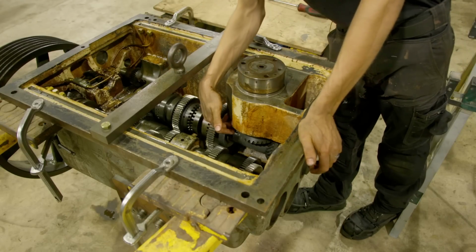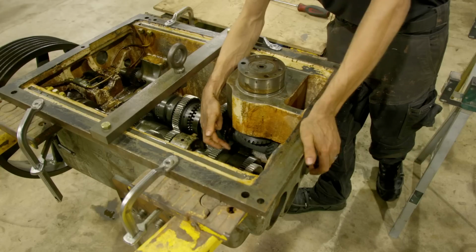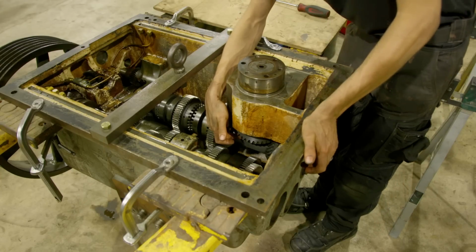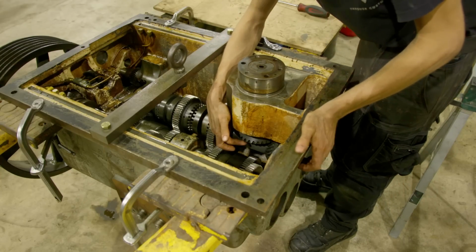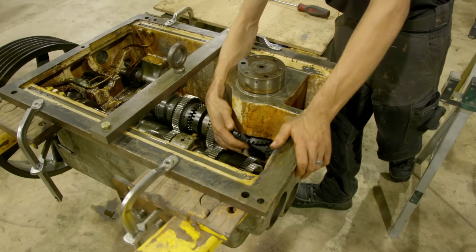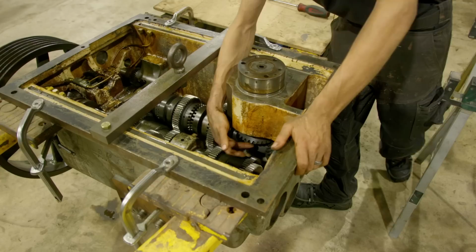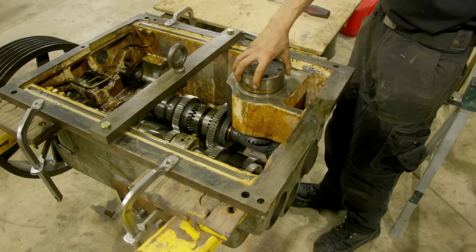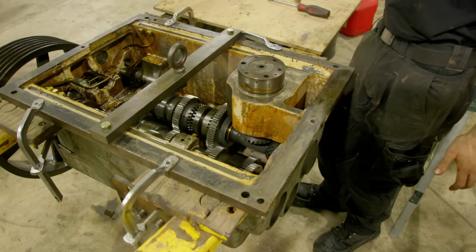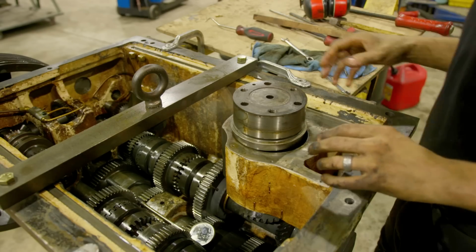On the bottom here is kind of hard to see, but there's a bevel gear, there is a Castle washer, and a Castle style nut. And so we need to remove both of those, and there might even be a circlip down here just based on using my mirror, and it is really tight, so I'm not going to be able to show that, but we'll get those 3 items removed, and hopefully we'll be able to pull this out the top and access both of those bearings. It's really, really hard to show.